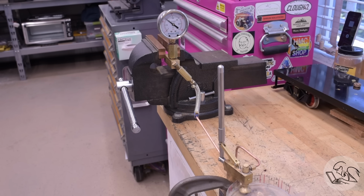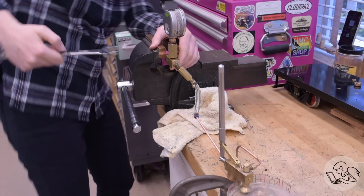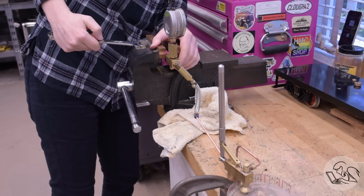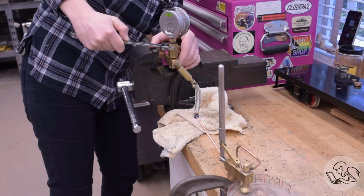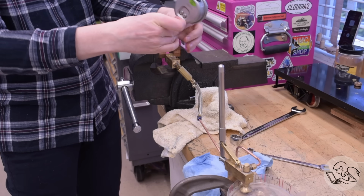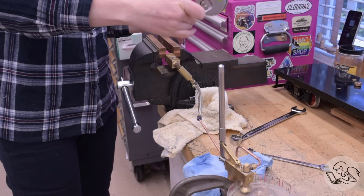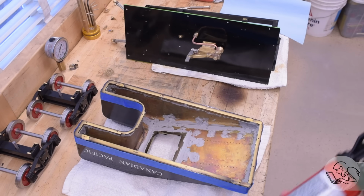And in fact, the whole system is now holding about 100 PSI, which is kind of cool, even though, again, holding pressure, not important to this test. Well, I can bleed down the pressure now nice and slowly because that is a successful test. The whole system now is handling 150 PSI, no problem. That's probably 3 times what any of this plumbing is ever going to need to do, so I'm very happy with that. It's a big moment now, though.